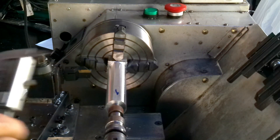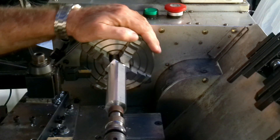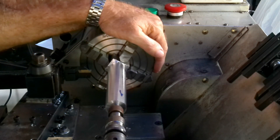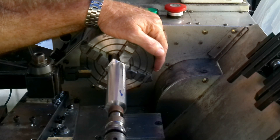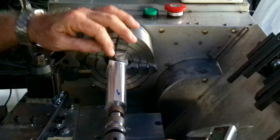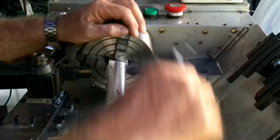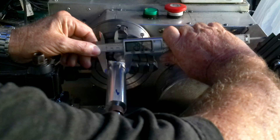So it's actually the next day. I set this up in here just roughly because there's quite a bit of meat to come off this — I wasn't overly careful with how I actually set it up. I took a couple of cuts off it, knocking the corners off, and checked to see how I was going. That little bit of taper I get when turning turned into a whole lot of taper over this distance — there was a half a millimeter or a little bit more between there and there. I spent three or four hours yesterday afternoon trying to get rid of that, and I'm pleased to say I eventually did. I'm pretty happy with the result.